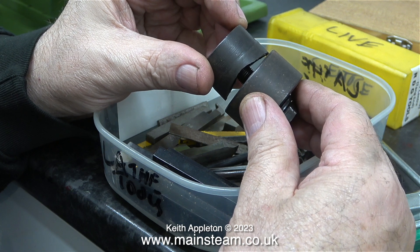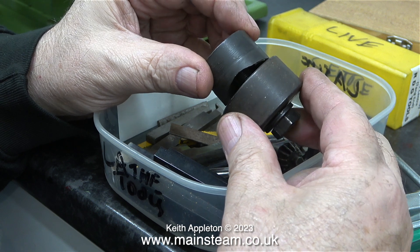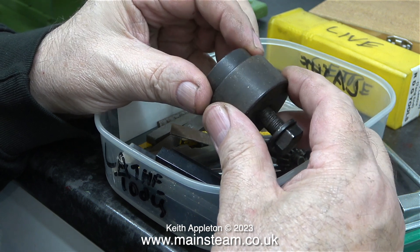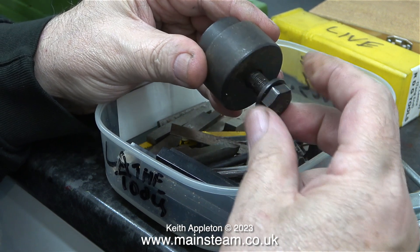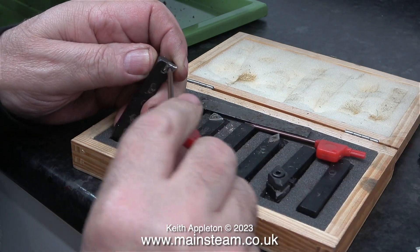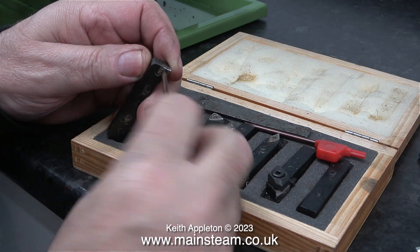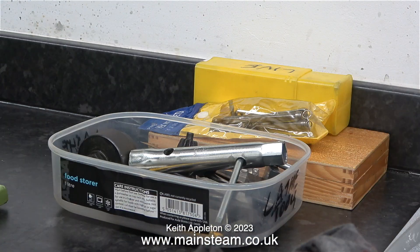This is an interesting tool — it's actually a hole punch, quite useful for punching a hole in a thin piece of sheet metal. You just drill a hole the size of the bolt, reassemble the parts and then just tighten the bolt to cut the hole. With this lathe were also a set of lathe tools, a little bit beaten up and possibly not the best quality I've ever seen, but carbide tip lathe tools are always useful. That's it for this part of the collection.